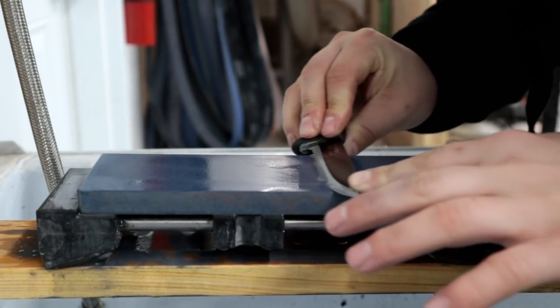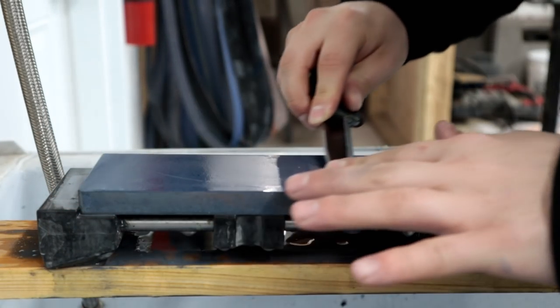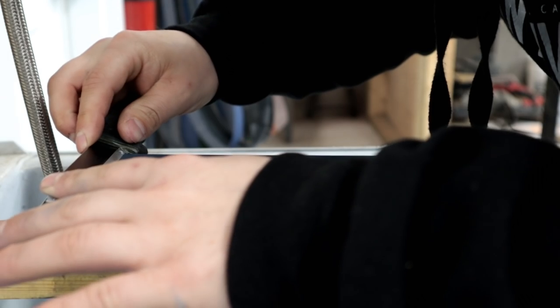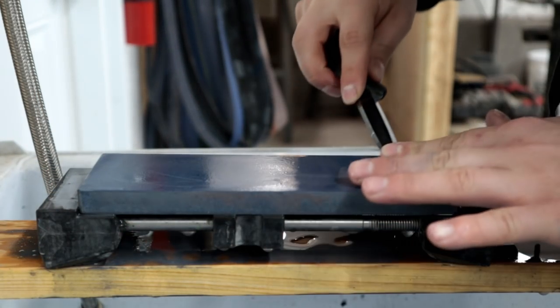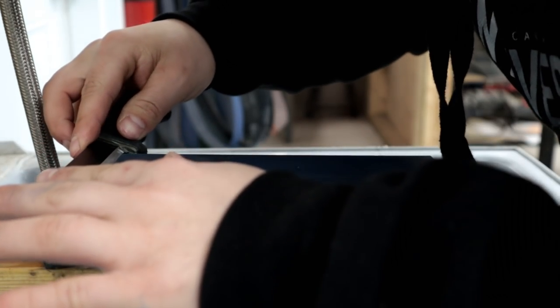Single cutting strokes only, making sure to stay right up to that apex. So lots of pressure forward now, and this will just help remove that burr, because we're really concentrating on that apex now. We were doing forward and back strokes all along.